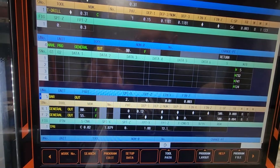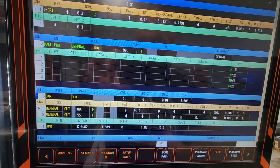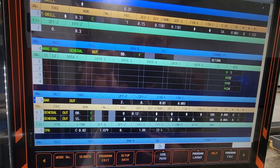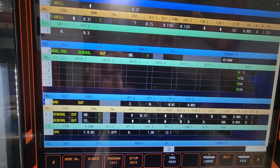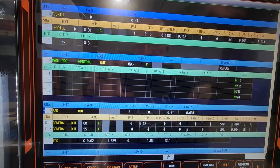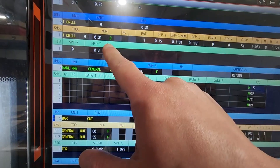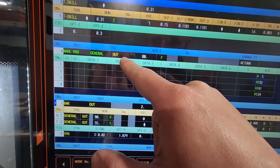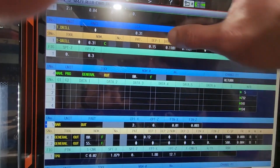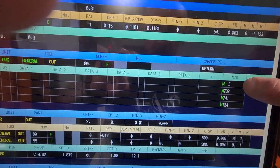The thing is, if this is what you're going to do — sometimes if you're changing tools, if the machinist's turret is actually turning, your RPMs will continue. So your chuck is still going to be rotating. In that situation you have to put an M-code to actually stop the part from spinning until the tailstock is going to engage. So you can either use this tool as a tool, or you can do the next one which is going to be an 80 finish. In this case, change tool — I got it as a return, and these are my codes.